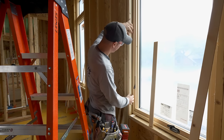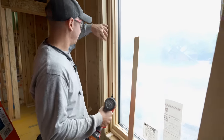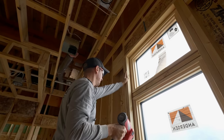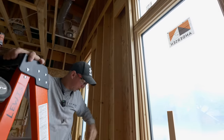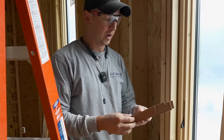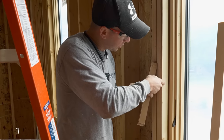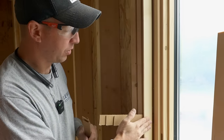We've got a nice big window here in the master bedroom. I'll start stapling my shim on at the bottom and then go up top to see where it matches up where I want it to be. The rest of the area I'll need to shim out. We've got a couple of options here — these are one-sixteenth-inch drywall shims. You can insert these behind your wood shim and build them up as much as you need. Here I can see I actually need almost three-sixteenths, so three drywall shims built up would bring this in plane.